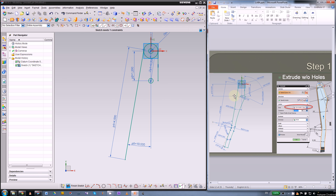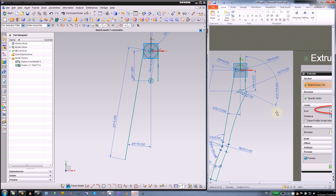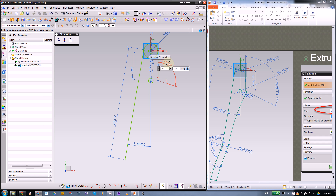Now we're going to make this small step here — the shoulder. The angle with this vertical line will be 1.5 degrees, and the length is 0.1 inch. Make sure this one is tilted — 0.1 inch.